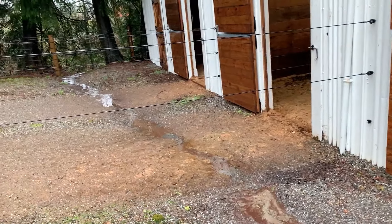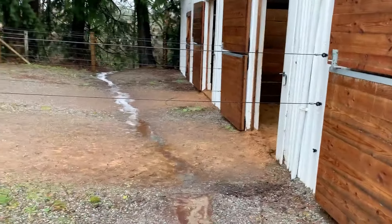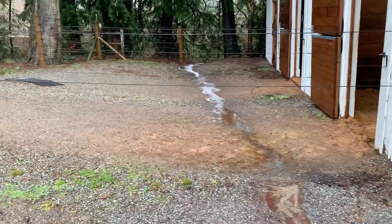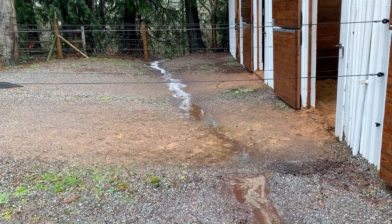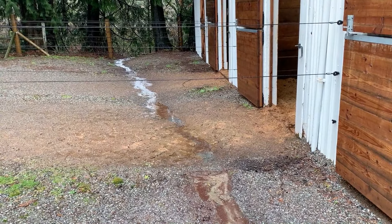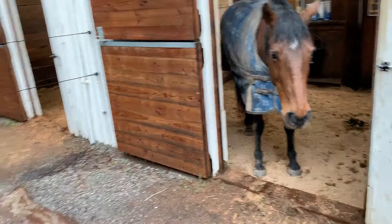What we did was create a low spot between the hill and the barn — we just cut in and sloped it down to that low spot, and then it slopes back up from there. As you can see, this low spot gradually gets further and further away from the barn as it moves toward the backside of the paddocks, creating a little bit of a river. The water flows into that low spot and then runs off over the hill into the woods, so there's no standing water within the paddocks.